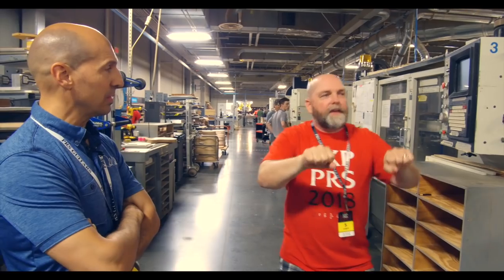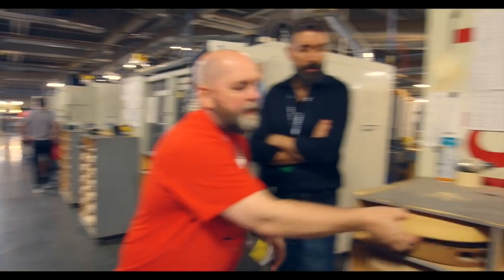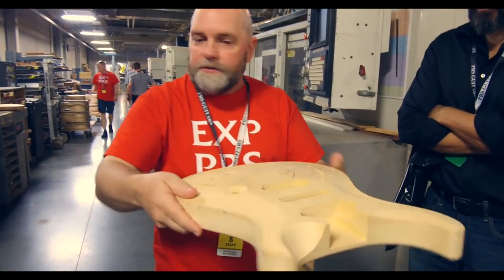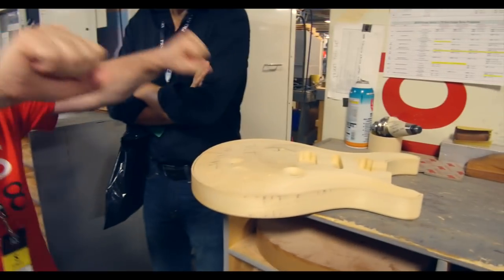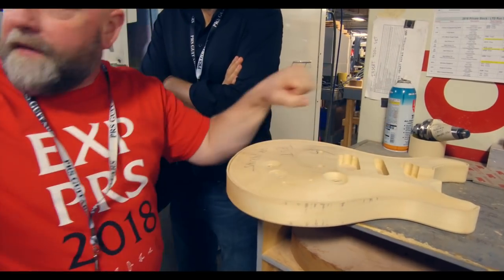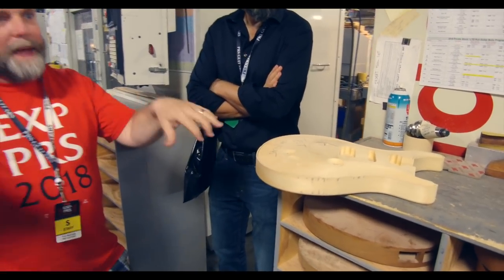Yeah, I remember that. Same thing. The operator had a dummy drill bit. We had an aluminum jig of the top of the guitar shape, and they would take this dummy drill bit, plastic bit, and push it over the shape, and then it would carve the body on this side. Okay. So it was like one top at a time.